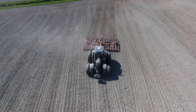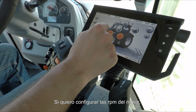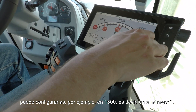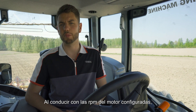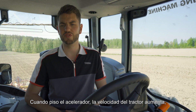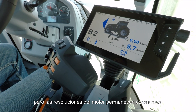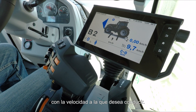If you want to set engine RPMs, you can set them to, say, 1500 — that's position number 2. When driving with set engine RPMs, you control your forward speed using the gas pedal. When you press the gas pedal the speed of the tractor increases, but the engine revs stay the same. It does this by automatically matching the gear to the speed you want to go.